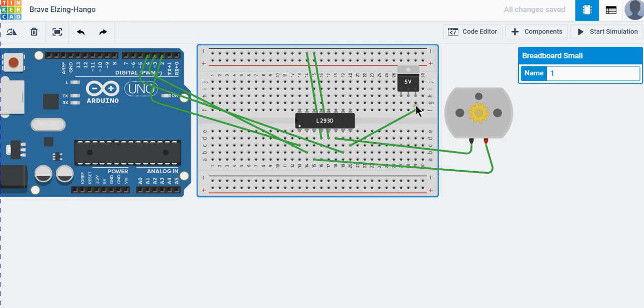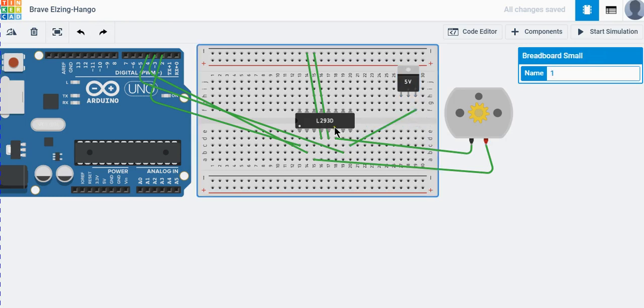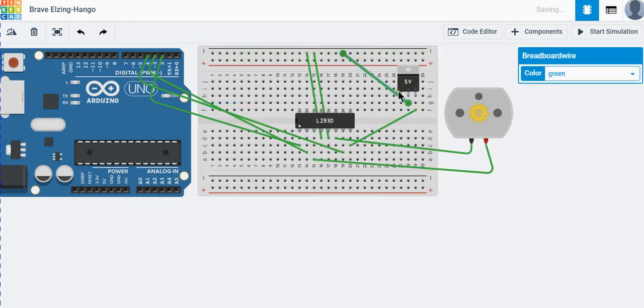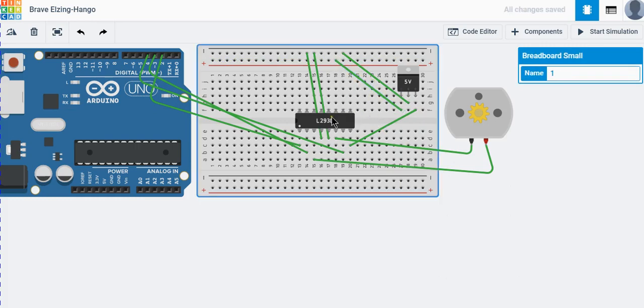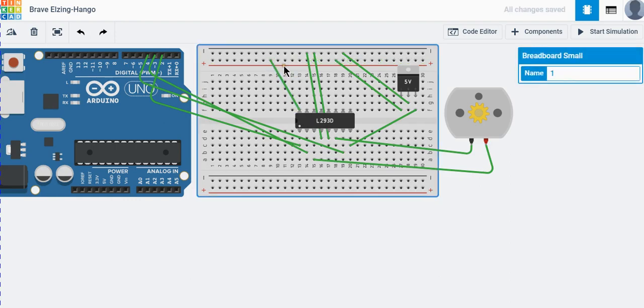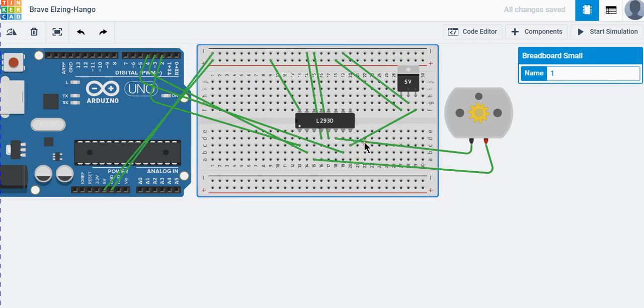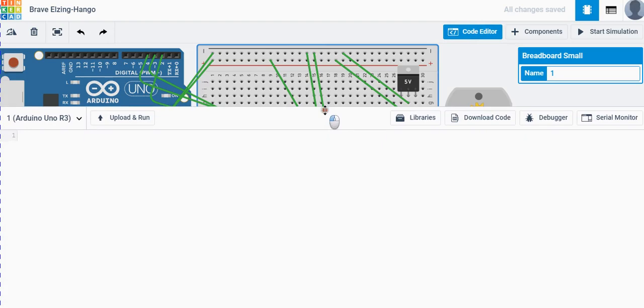The VS pin is the motor power supply — it connects to the output of the LM7805 regulator, which provides regulated voltage to drive the motor. The regulator's ground connects to ground, and its input connects to the positive supply. The VCC pin on the IC also connects to positive. Now the power supply connections are mostly done.